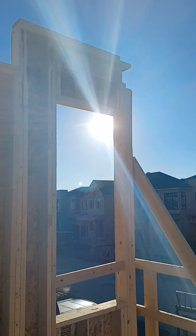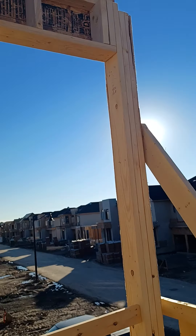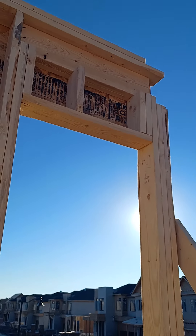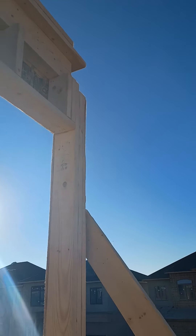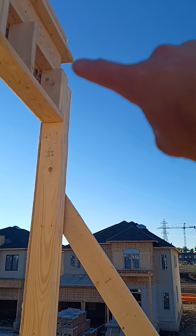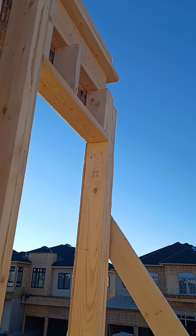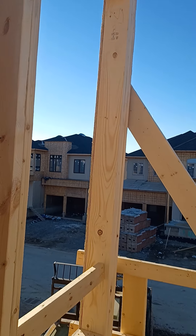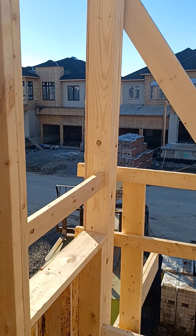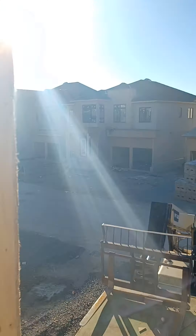Here's what you're seeing — it's an interlocking header. Basically I have two two-by-tens that are going to run in there staggered, kind of just like you do a porch. That's just a zero casing finish, kind of the same idea.